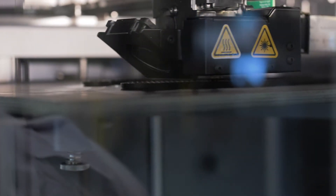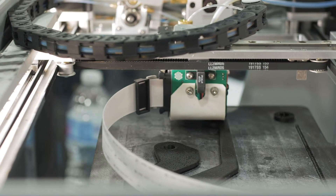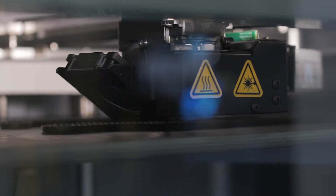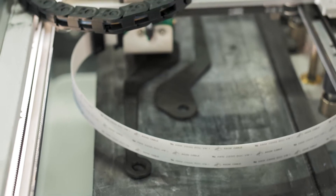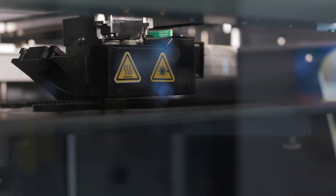So how do you get rid of the plastic material once you've printed the part? After you've printed it, it's the same post-processing as metal injection molding. You put it through a washing step that takes out half of the binding material, and then you sinter it in a furnace, which burns off the rest and causes the metal powder to sinter together into your final part.